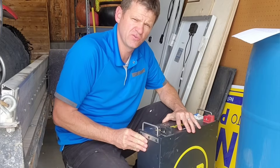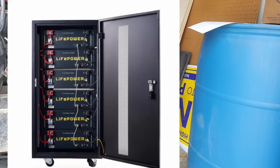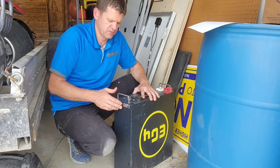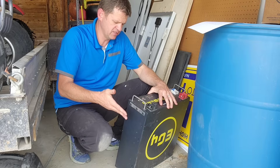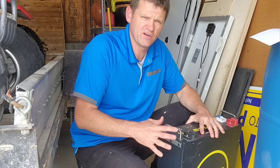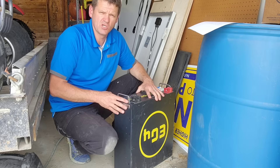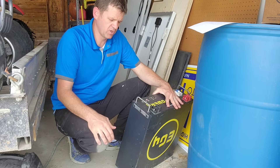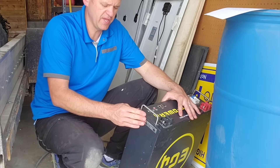So this is the setup I'm using. I'll be using one of these server rack batteries. This battery is designed to go in a server rack so you can wheel it around your garage, but it's mainly designed to power your house. This is a 48 volt battery, but it also comes in a 12 volt or 24 volt battery. At this standard size, they all contain pretty much around five kilowatt hours of energy. These batteries are really nice if you don't want to hook a whole bunch of those little 12 volt batteries to get a large battery bank. These are cost-friendly and they are designed to last a really long time. This one has a 10-year warranty.